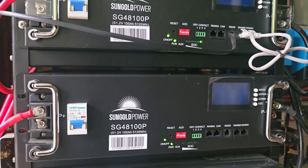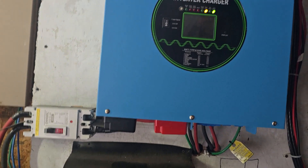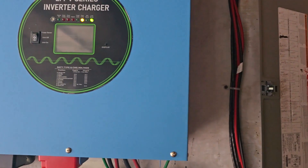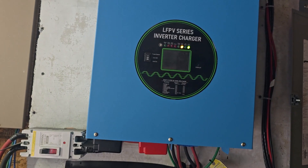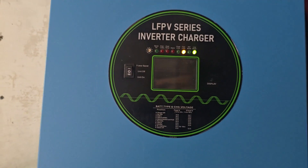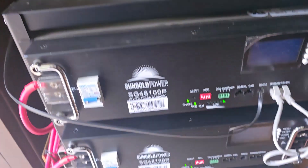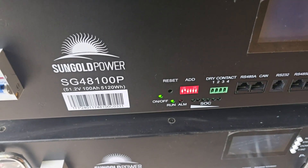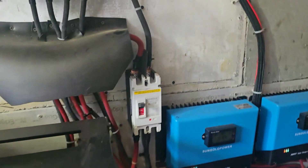Right now it's charging off the house because the sun's not really out yet - it's cloudy. I'll let it charge at least halfway before I turn the AC power off. If this is charging, you can come over to the panel - that 100 amp breaker right there is what's charging this, the AC end for the onboard charger. I can turn that breaker off, kill the commercial power, and then it'll use solar power until the batteries go dead again and then kick back on. That's one way to save power.